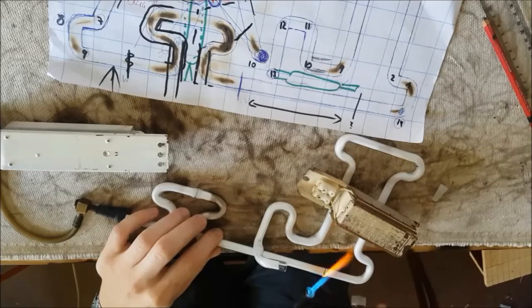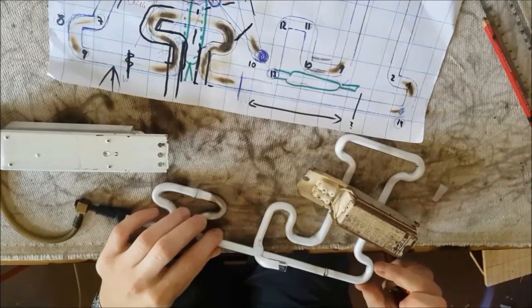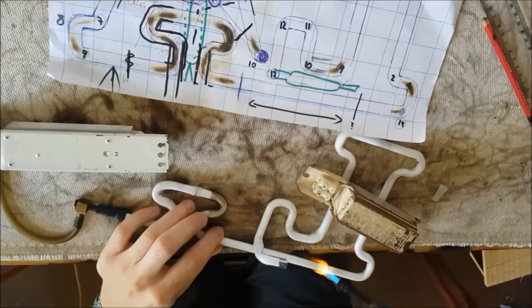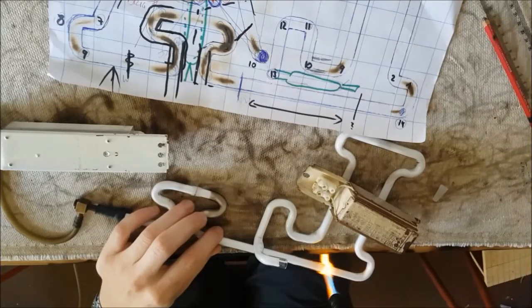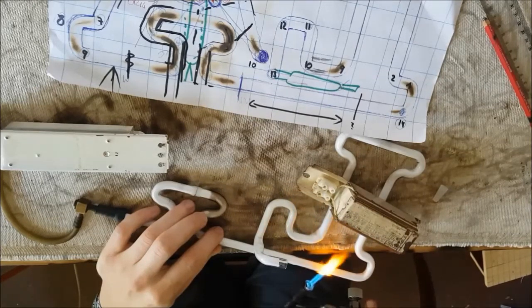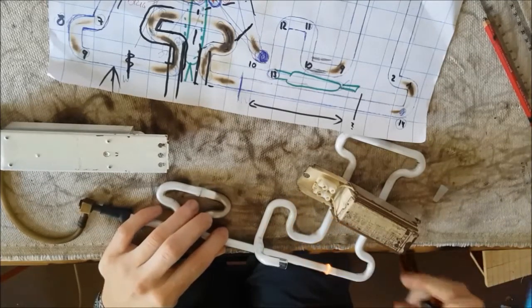Some neon experts told me that there are phosphors that like to crack the glass in welds, especially when the phosphor has melted into the glass at the weld. As I had welds in the visible front area of the tube here, I only removed like a millimeter of phosphor of each end of these tubes because I still wanted it to look nice when it's illuminated, and that increases the risk of that weld breaking.